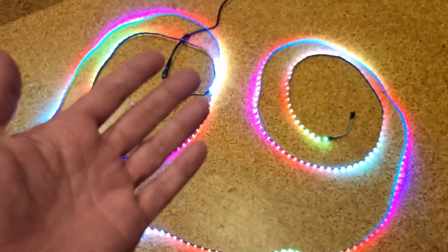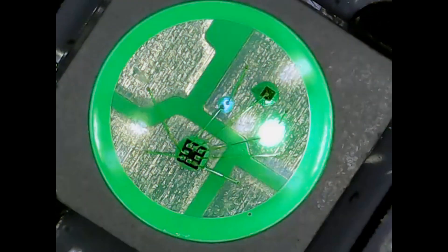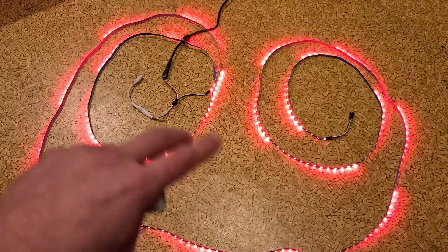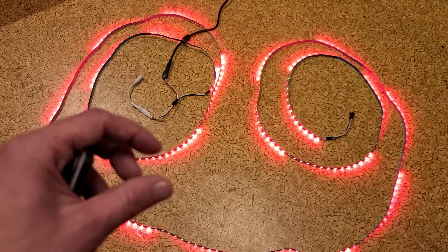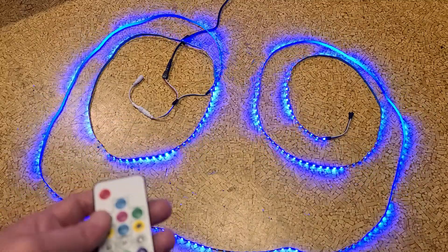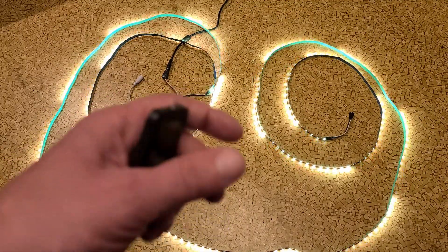Let me put up an image on the screen of what the inside of one of these lights looks like. There you go — you're able to see the chip. In the still image you can see that was actually the microchip. You have the ground wire and the three wires going down to each of the LEDs. Surprisingly, that chip at the bottom is the red LED, and it needs to be much larger to get the same equivalent light output. The big chip in the top corner is actually the controller. It has positive, negative, and a digital wire going to it, and then four wires that drive the three LEDs with the common ground. That's what makes these more expensive — that integration. It's also interesting that they have a translucent mounting, which helps the light broadcast off the back of the chips.